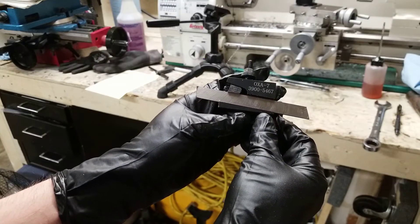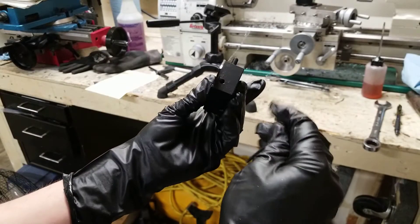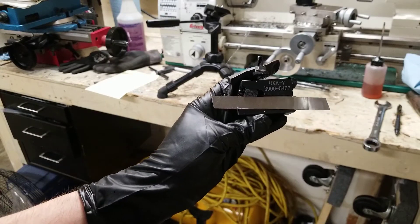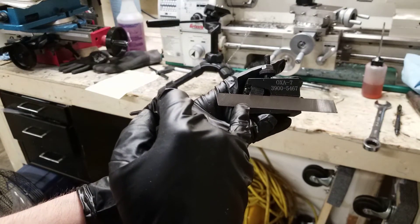Once you have finished sharpening your blade and return it to your tool holder, don't forget to tighten it extra tight or else it will slip while you're cutting. And this is how you sharpen a cutoff blade — this is just high speed steel.